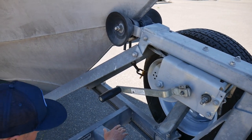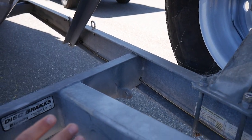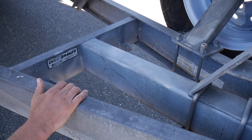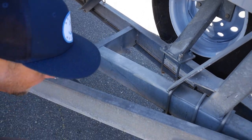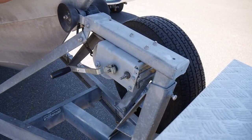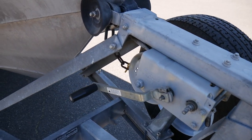This is a Pacific trailer. These Pacific trailers are built really nice because instead of being bolted together like most other trailers, these are welded together and then galvanized. That makes it so all of these areas where you normally have bolts that would rust out, they don't do that. It's open-channeled so water can't get trapped in it either, making it a much higher quality and longer lasting trailer.